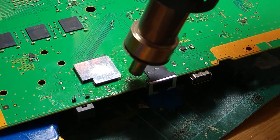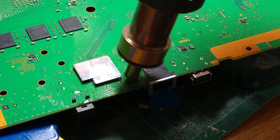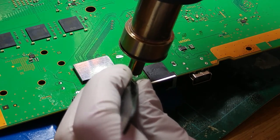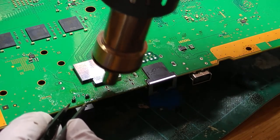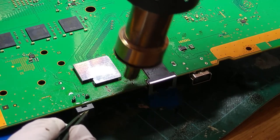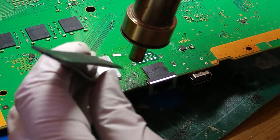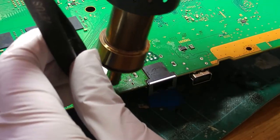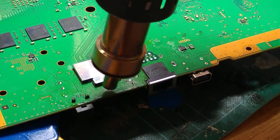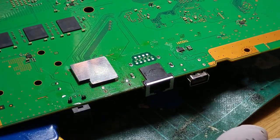So far I haven't actually done much work with the fume extraction and the air gun whilst using this headset, so I'm not entirely sure how it sounds — it's going to be interesting to see how the next couple of videos pan out. I can see that the solder in those holes is now starting to go a little bit shiny, which hopefully means I can start to push the remnants of these pins back through the board.